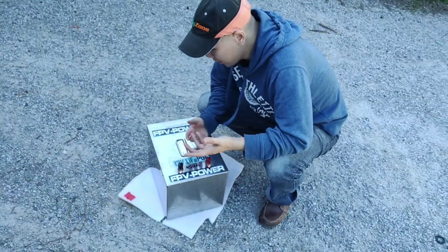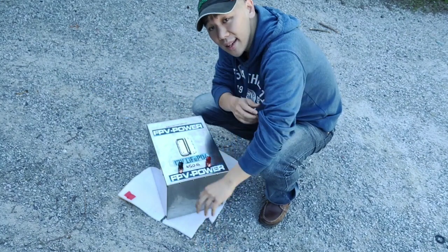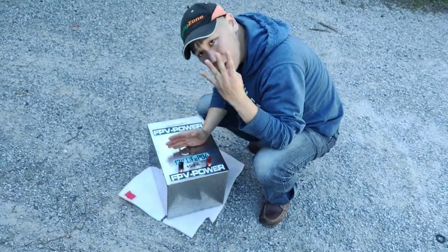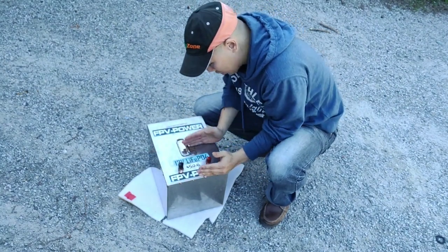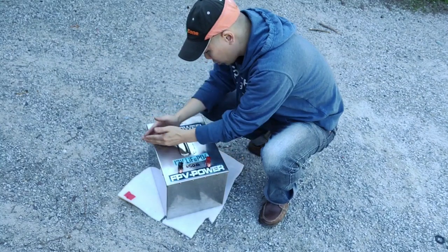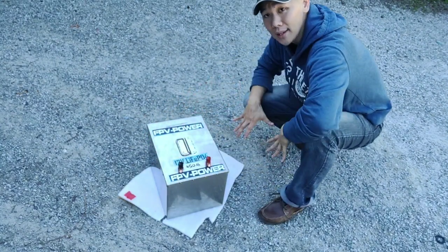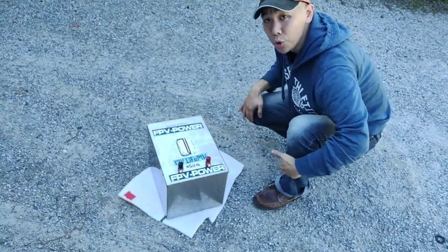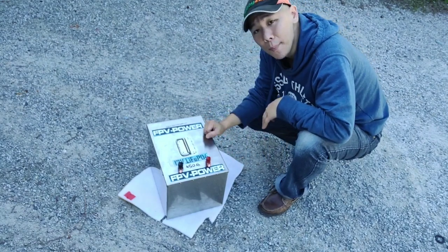Just to go through a bit more in detail the comparison between what he had, the lead acid. He had 6 volt lead acids. He had 4 of them. He had a 6 volt 220 amp hour, another 6 volt 220 amp hour, and he had two of them. He had two bays of this size, so he basically had a 12 volt 220 and another 12 volt 220. So in total 12 volt 440 amp hour, which he had.